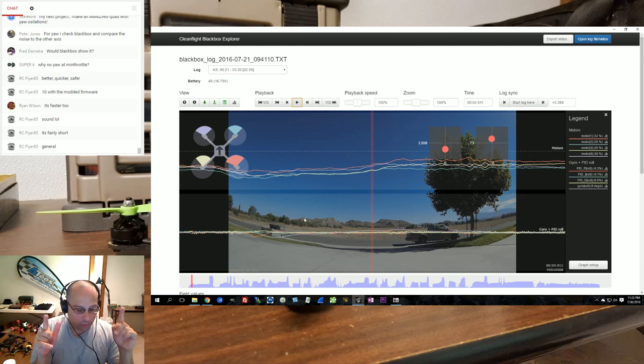But the P term is not perfect. The P term leaves some mess behind, but the P term hasn't got time for that. The P term is moving on. So anytime there's some error left behind by the P term, the I term's job is to come behind it and pick up that error. The I term is like the memory of the PID loop. The I term says, hey, P term, you forgot this. You didn't clean up this error. P term's like, forget it. I'm cleaning up this error right in front of me. I term's like, yeah, but you're going too fast. You're doing a sloppy job. I'll get it. Okay, I've anthropomorphized the PID loop a little too much.